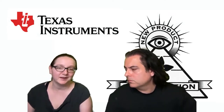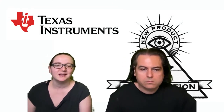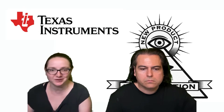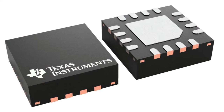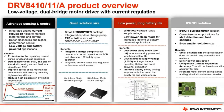Okay, this week's NPI, I was actually excited about this. It's the DRV8411, a series of new motor driver chips from TI, and I love their driver chips for motors. It's available in both QFN and TSSOP power package, PWP package. Right now, Digi-Key only has the QFN in stock, but the TSSOPs, I'm assuming, are coming soon.